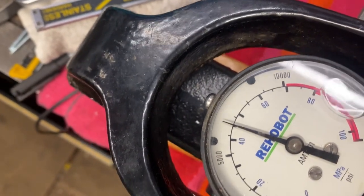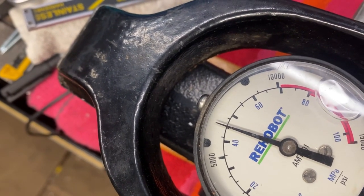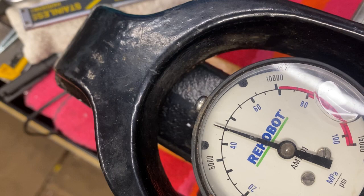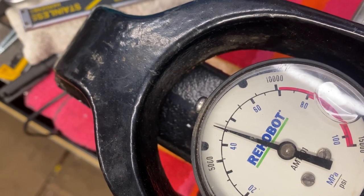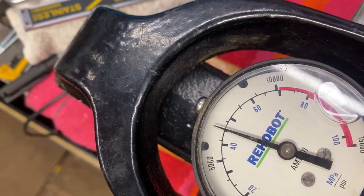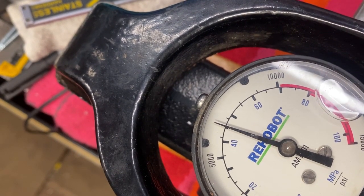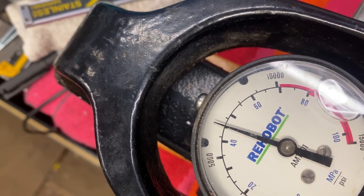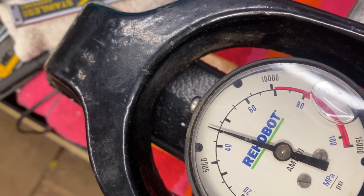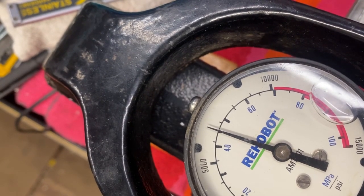The pump piston is leaking, that's why it's so hard to pump. This pump isn't designed to be used with water glycol mix. It should have hydraulic oil, but I don't like putting oil into the air cylinders, so I use water and service the pump once in a while. I could put another cylinder between which has a piston that pushes the water. I've been thinking about doing that, but haven't gotten into it yet.